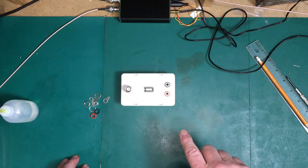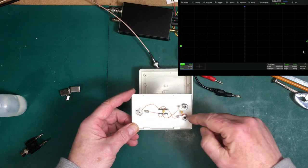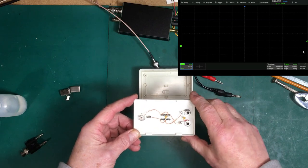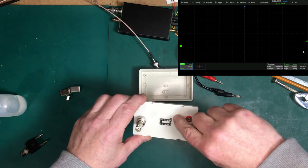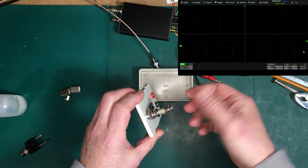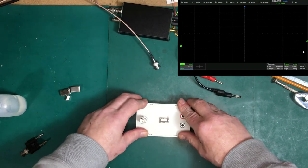Anyway, I'm going to get this cemented down. When the cement cures, I'll be back to wire it up and then we'll give it a little test. Okay, we're back. We've got it all wired up. I put a 1µF capacitor across here and a 0.1µF across VCC to ground. It's all ready to be checked. I even put a little mark there for pin one. I've got a power connector in here right now to make this a female. Let's get brave and snap it in place.